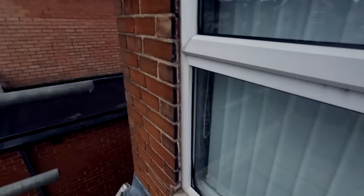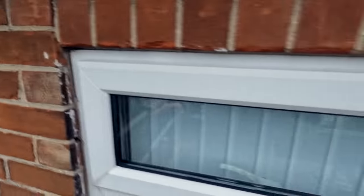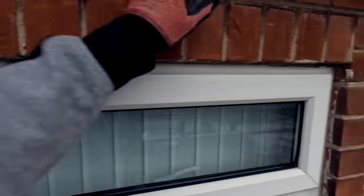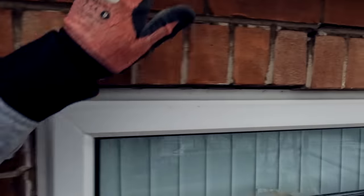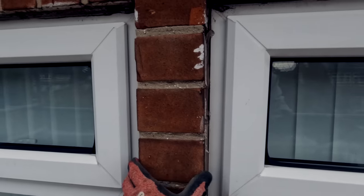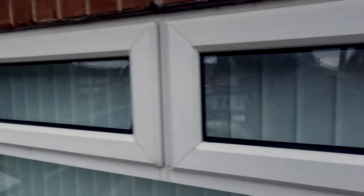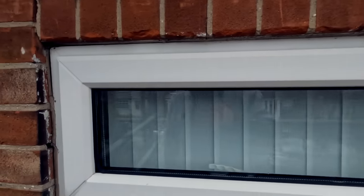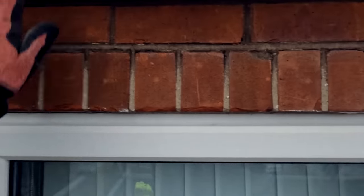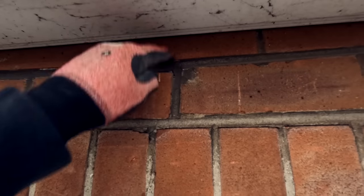The house isn't insulated, as you will have seen in the other video we did, when we did the kitchen window down there. But we did insulate behind the lintel, and we're going to insulate above this lintel, so that if they ever do get the insulation blown in, then this bit will be sorted. Obviously, this isn't ideal, but that's the design of these houses, some fun designs. So that's the plan. Once Alex gets the dust sheets out, we're going to cover the windows up and I'm going to start taking this out. The only fun bit is getting the last couple of bricks in.